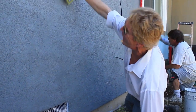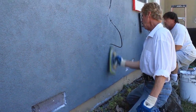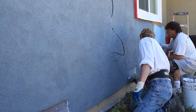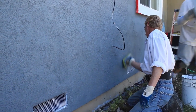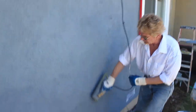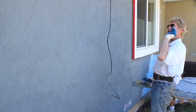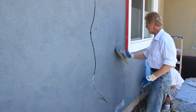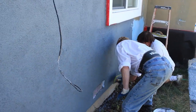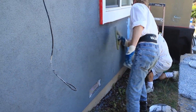Beautiful Bill, beautiful — boom! Okay, we're hustling now. As I said a second ago, had I done this wall first we would have been relaxing. We got here about eight in the morning and now it's about one o'clock — three to four hours in. This wall is just drying out and that's the nature of it. There's one thing to do a small wall or small sample, but you do a whole wall you better know what you're doing. When this dries it's all going to be the same color and the same texture. You can't cover a texture unless you're using a heavier texture — that's why we're using the 16-20 all the way to that corner.